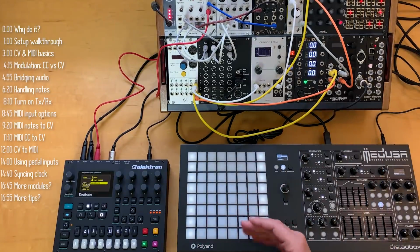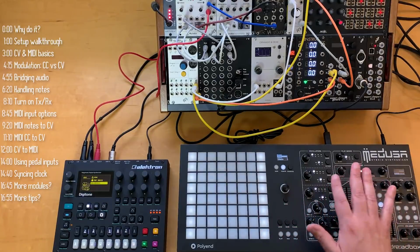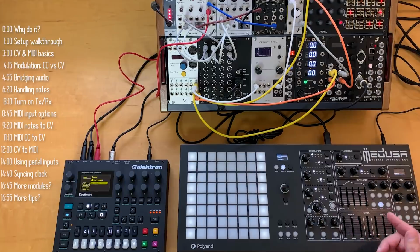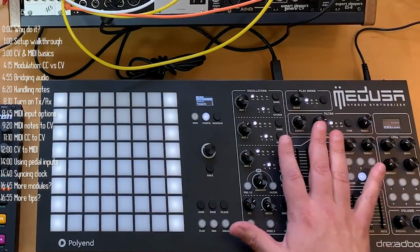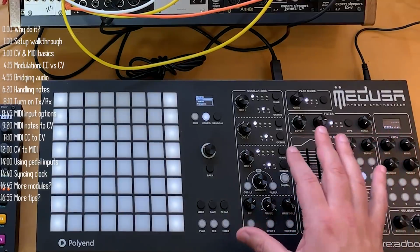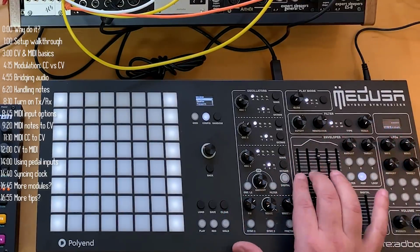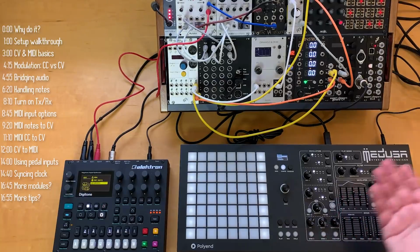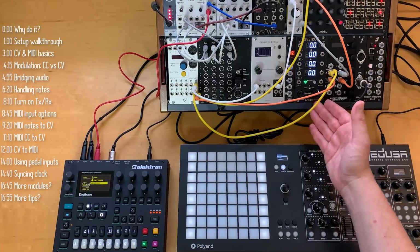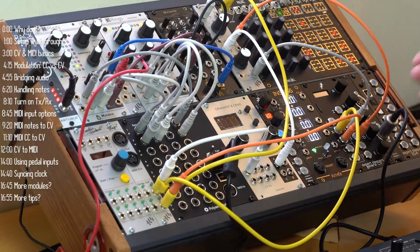Now, aside from mod wheel, aftertouch, and pitch bend, some MIDI to CV modules will let you assign any CC channel to voltage as well. Now, there are at least 2 cases where that might be useful. First, most digitally controlled synths, even if their core engine is analog like this one, also send CC information as you move the sliders and knobs. This information can be sent, say, to a module like Aither here, and then converted to control voltage to control anything in your Eurorack setup.